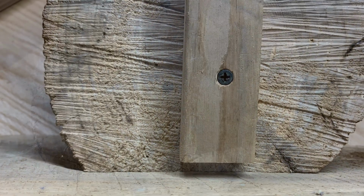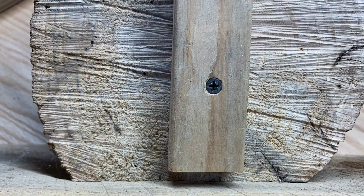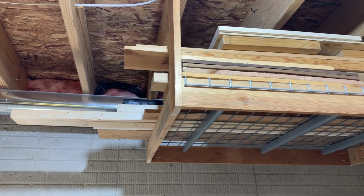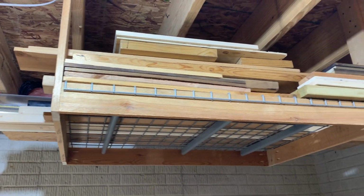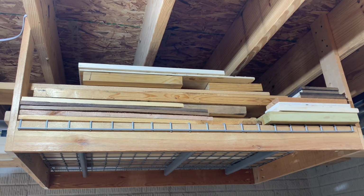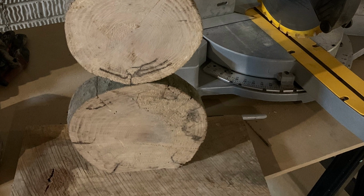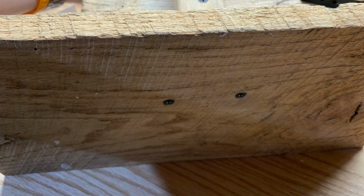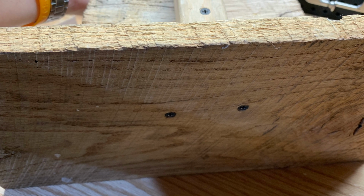Next, I picked out a base from my scrap lumber rack. I used a true 1x8 piece of lumber from an old torn down barn as I was going for a rustic look and cut it to 16 inches. Before attaching the logs to the base, cut the bottom 8-inch log so it sits flush on the base. Center the logs on the base, pre-drill, and screw in 3-inch screws from the bottom.